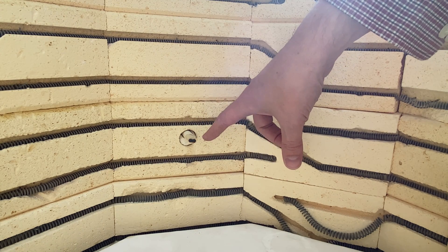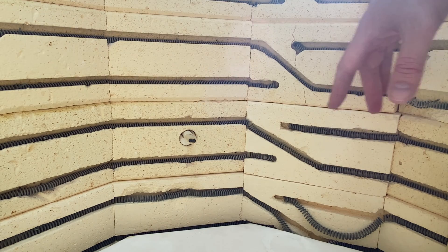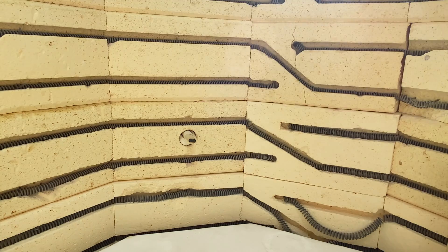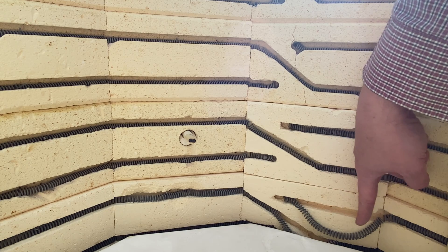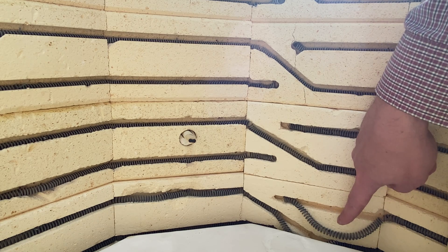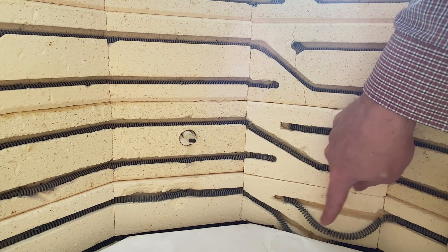If you look, it's a little bit corroded and there's a crack here on the ceramic piece. Everything else in the kiln is looking pretty good. There are some cracks and a few pieces that chipped out, but those aren't really significantly worse than when I started. One thing you'll note down here is that some of my elements have come loose — I recently noticed that, and what I did is take some wire used to pin these in and basically put it under there to support them.